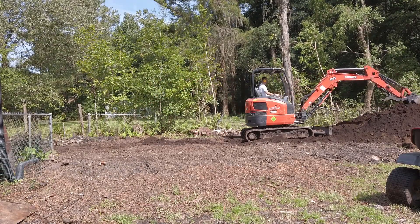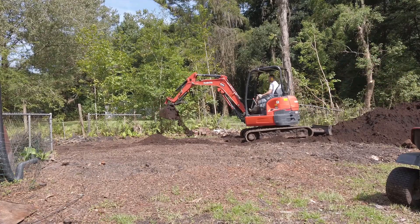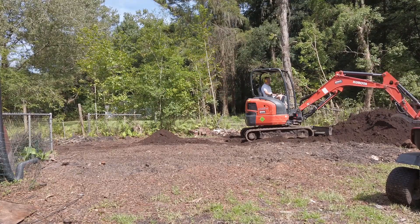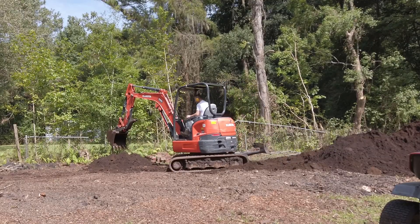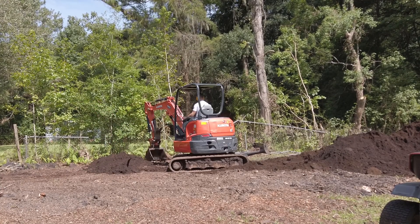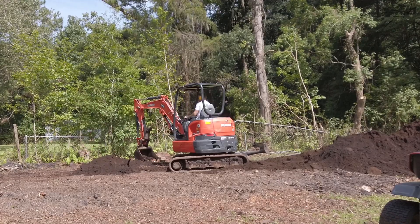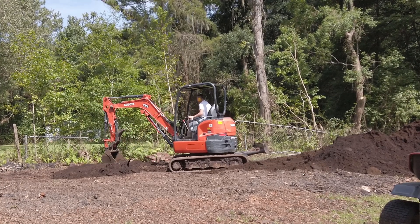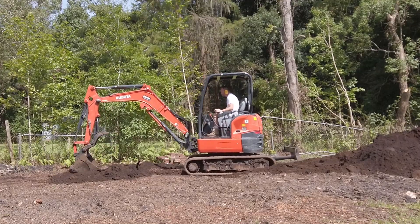It truly does all start with site prep. I believe this one step is so integral that the lack of it is the number one reason you see so many sheds leaning, sloping, and sagging in people's backyards under their own weight. In my case, I have a very specific set of circumstances to overcome when designing what type of foundation I'm going to use, because our property has certain characteristics. Our water table comes pretty close to the surface during the rainy season and then recedes during the dry months - I'd be willing to bet it's just a few inches, maybe a foot at most, below the surface.